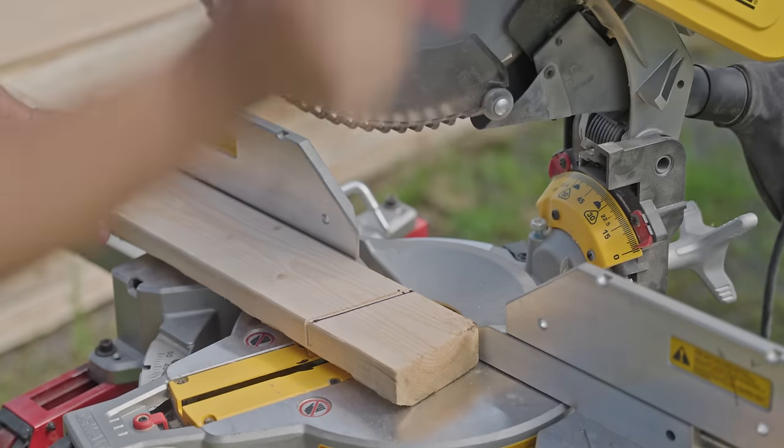Okay. Remember when we talked about we've got a determined inch and a quarter overhang here? Nice, that's perfect. What I can do is, as I'm coming along, measure my inch and a quarter every time before I attach my rafters. Now, I'm in the wrong screw bit here.